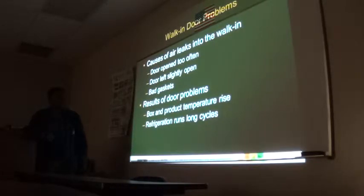And also your box temperature will rise, because if you have ice buildup, you lose heat transfer, therefore the box temperature will begin to go up. Product will spoil.